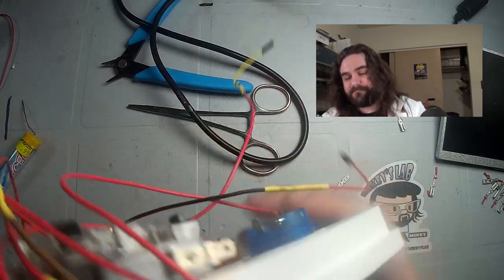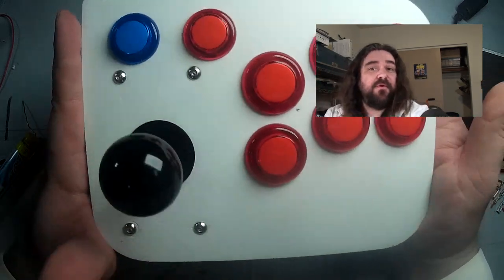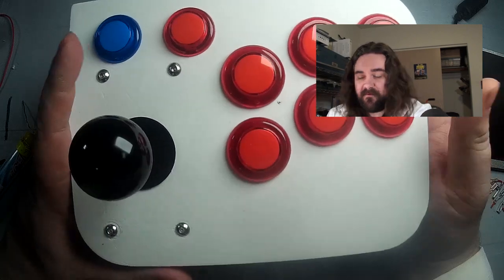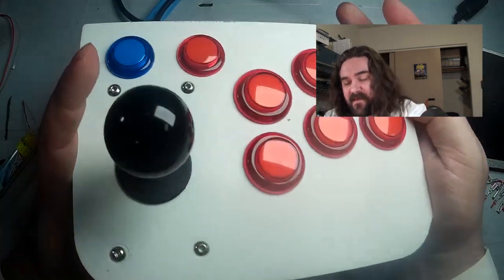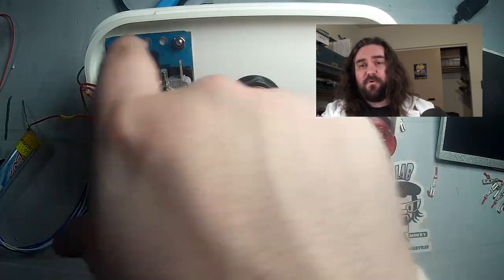This is the orientation of the control pin. One of the traps for new players when working with retro gaming arcade stuff: if you push up on the joystick, it activates the bottom switch — so the controls are inverted. Left is right, right is left, up is down, and down is up. We have to keep that in mind when we wire this up. The joystick came with cables to hook them up. We're going to use those cables but I'm only going to use the single signal wires, and we're going to do a common ground across all four push buttons in the joystick.